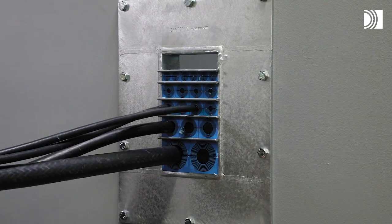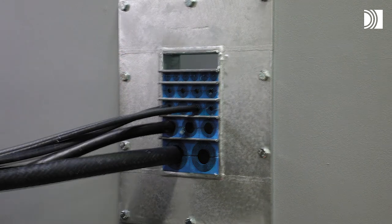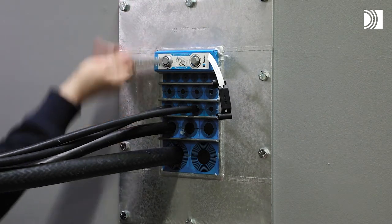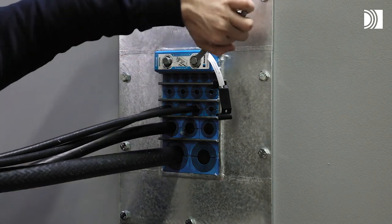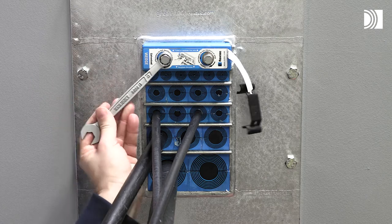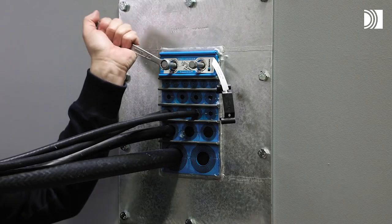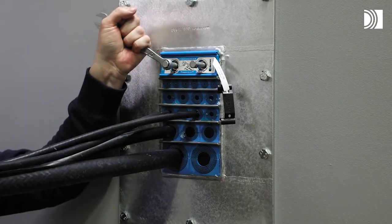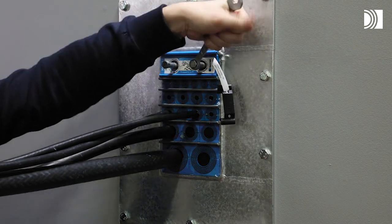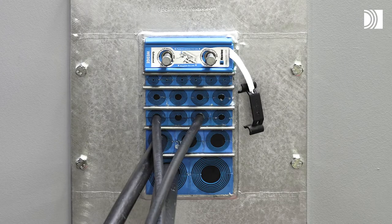Tighten the seal. A Roxtec pre-compression tool can be used to make room for the wedge if necessary. Insert the wedge and make sure it is accommodated and secured by the stay plate. Tighten the screws alternately until full mechanical stop. The wedge will compress and seal the transit, and the excess lubricant will be squeezed out. Excess lubricant is a sign of good compression.